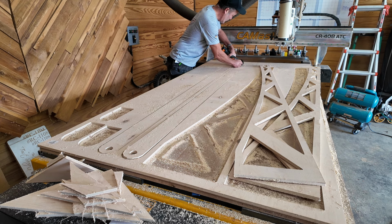Now let's clean this off one more time just like it's a workbench, because in this case it is. Both of our workbenches have projects on them, and this will become our assembly space for this project. I recently broke my ultra smooth cutting combo bit for my CNC, so I had to use an up spiral bit, which leaves a little bit of tear out. So Cameron grabbed the palm sander and went around and basically took all the little wispies off the wood to make it nice and smooth.